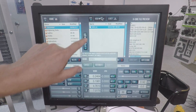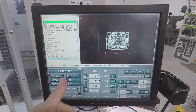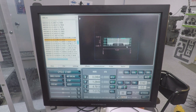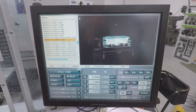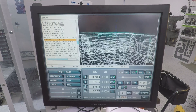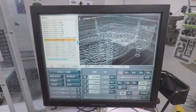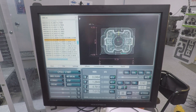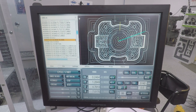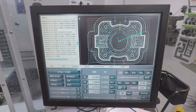We copy our CAM file into PathPilot. One of the things I really like about PathPilot is the visual interface — really, really nice. Here we're looking at a top-down view, but I can right-click and switch to front view, and it gives me a really good idea of what's going on. I can jog around, and you can even do this while the machine is running. Remember Mach 3? PathPilot does a really better job of being able to triage what's important and control the machine with first priority, giving you sort of second priority to still handle some graphics stuff.